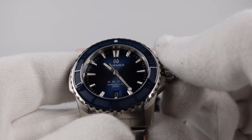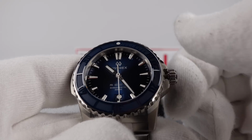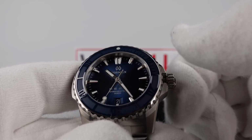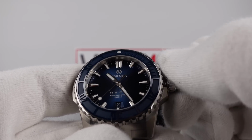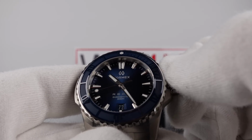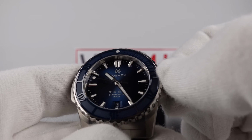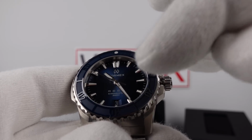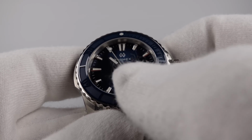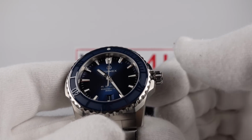In terms of resistance, it feels very similar to the quick set complication on the SW200-1, which is a lower grade of Sellita movement. The SW300-1 is more premium grade. The build quality, materials, quality control and finishing are higher grade, but the quick set complication feels the same. There's no discernible difference in the quick set date on a 200-1 and a 300-1 respectively. So nice light indexing, but it does align very well. The Arabic numerals are correctly proportioned, and they're not too far to the left or too far to the right. They align correctly in the centre of the recessed date window.